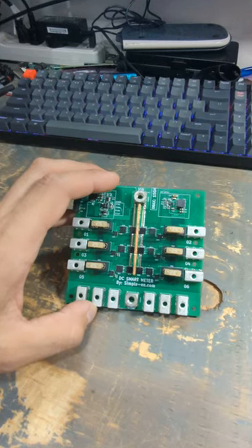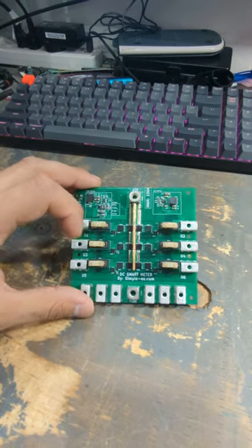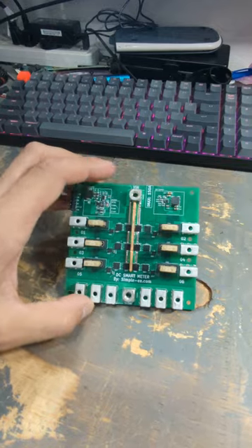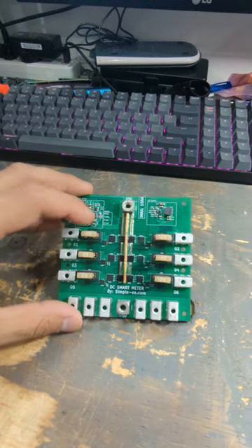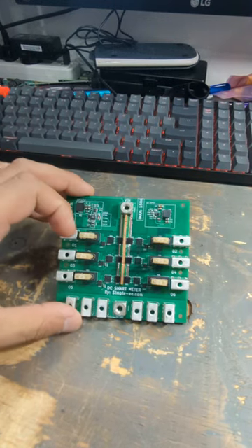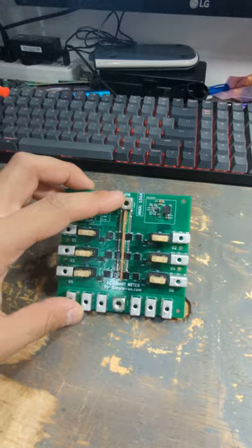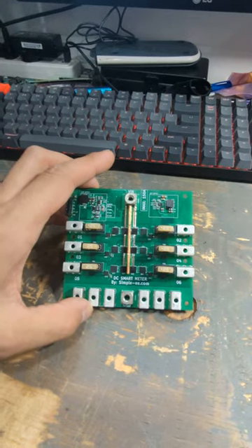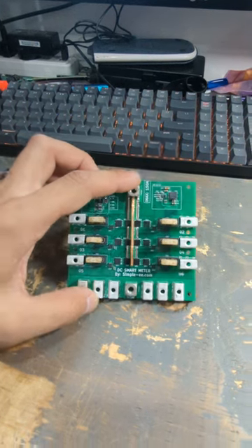In the morning when the sun's out, the solar charge controller starts charging the battery and I don't have to worry about resetting a switch. Here I can tie batteries and link them all together to a single input, so I can tie multiple batteries to be charged, or feed multiple batteries in parallel as a load bus. The lugs are M5 and can handle up to 160 amps.